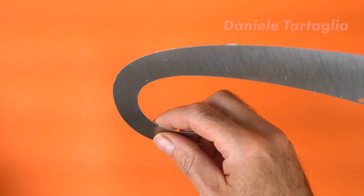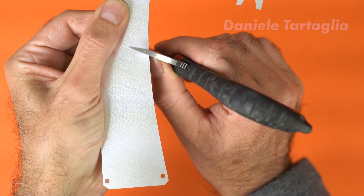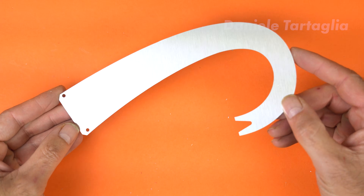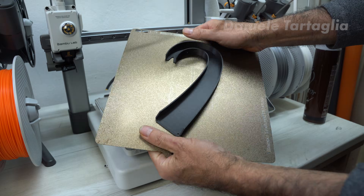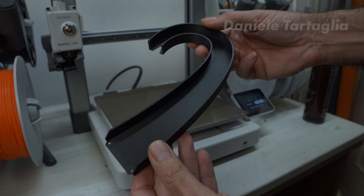I used a minus 0.2 millimeter offset to compensate for the deformation caused by heat bending. After trimming, it's finished and ready for the new ramp. This time it's black. White looks good, but black is on another level. Now comes the magic — satin aluminum combined with PLA.